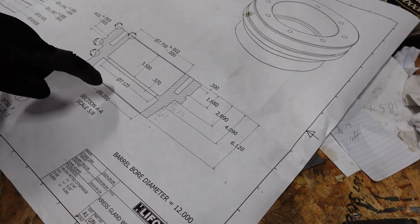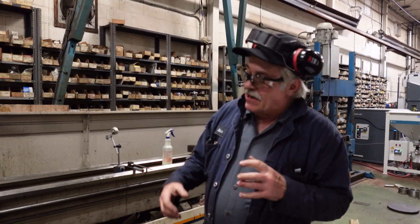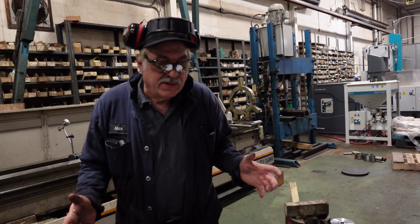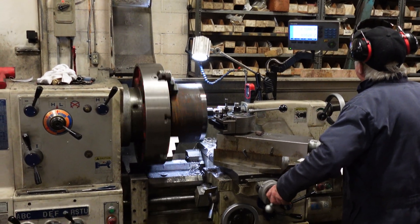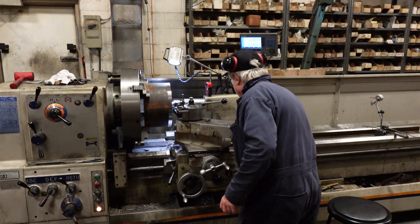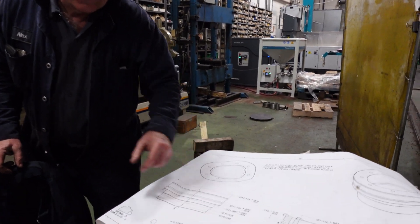This gives me the information necessary to make this object. I'll be starting to machine it now. I'll rough it down to the dimensions on here, probably within 30 thou. That's standard practice — take it to within 30, get all your dimensions done, and then start to finish it to the tolerances desired on the piece, which are right here.